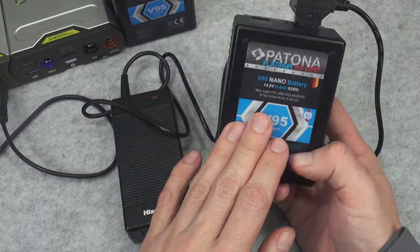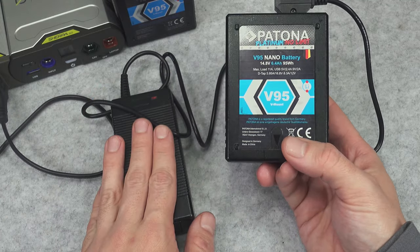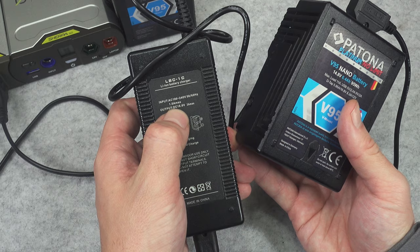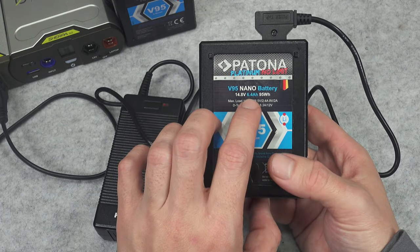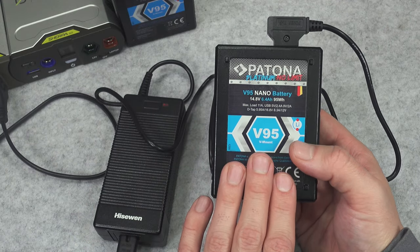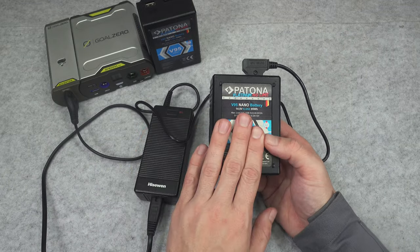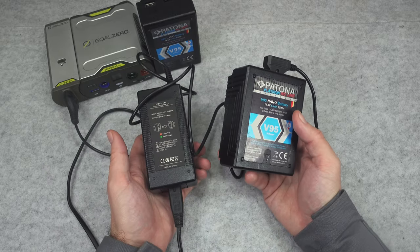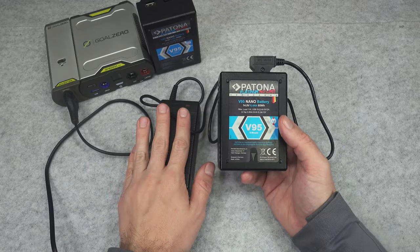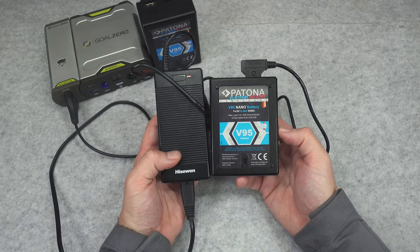This is an absolutely beautiful tiny charger. One last word of warning: since we're not measuring the battery temperature, I highly recommend keeping the charging current low. I chose the 3-amp version because my battery is 6 amp-hours, targeting roughly half-C. If you've got a 200 watt-hour battery, you can go up to 5 amps since those versions are available — so choose wisely. Thank you very much for watching, I hope you found that interesting. See you next time, bye bye.